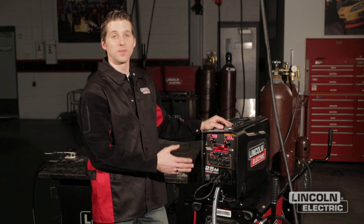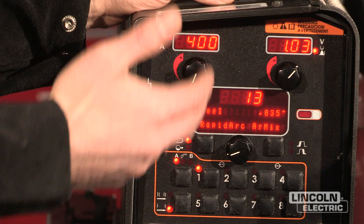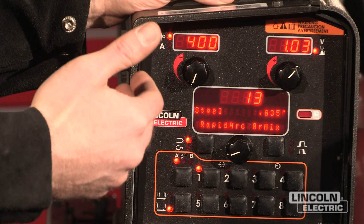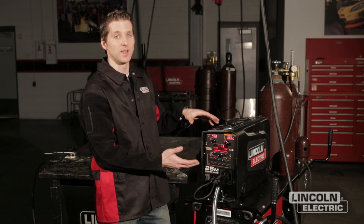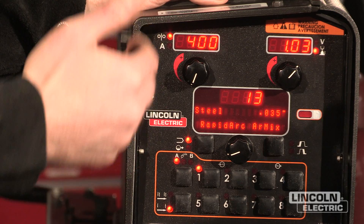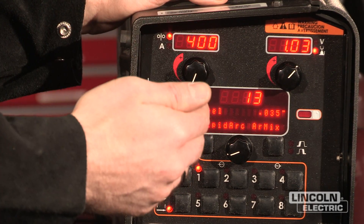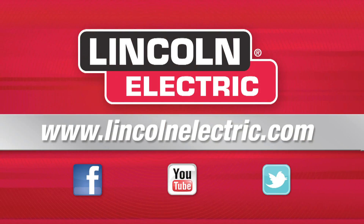Setting user limits is a great way to make sure that the procedure is run at the appropriate settings. Having too much wire feed speed or too little can cause spatter or cold welding. Having too much trim or too little trim allows for undercutting or lack of fusion as well. So by customizing the system and setting up the way that you want the operator to run is a great way to ensure that the quality is being built into the process. The user interface on the PowerWave platform was set up to simplify memory settings and customizations. For more information about this technology, go to LincolnElectric.com.